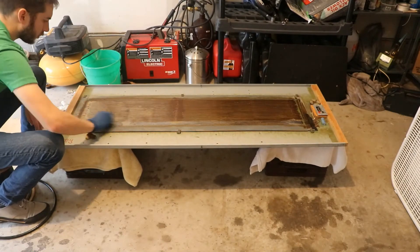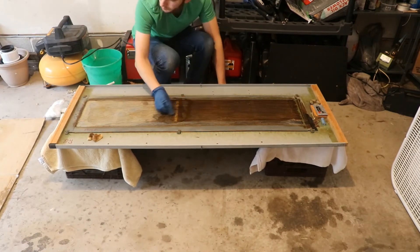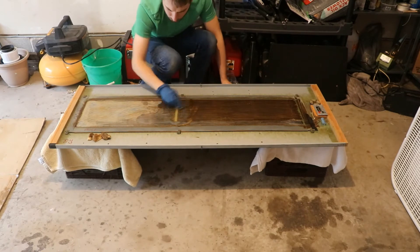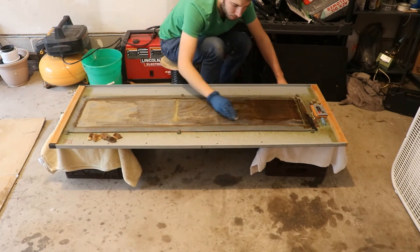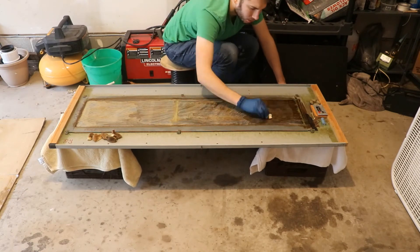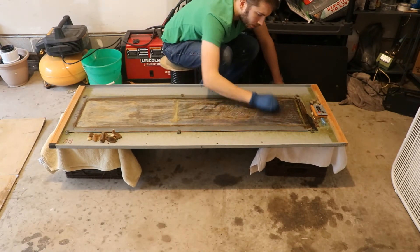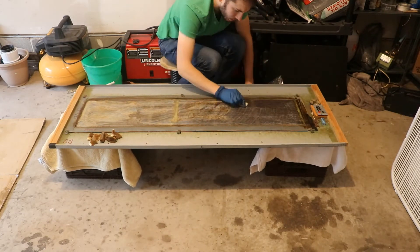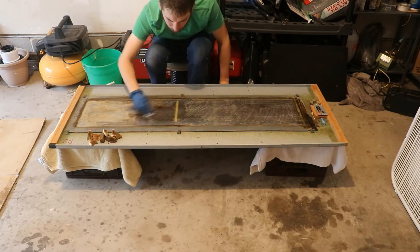When it comes to the corners, I just leave them in place until the end, and then use a heavily soaked cotton ball to remove the wire bends. Now I'm removing all of the old adhesive because you're going to need a very clean surface to get the new wires adhered to the diaphragm. Patience, use a fan, don't get your brain fried from the acetone, and eventually with enough cotton balls and enough acetone, all of the adhesive will come off. And that'll be the end of part one.